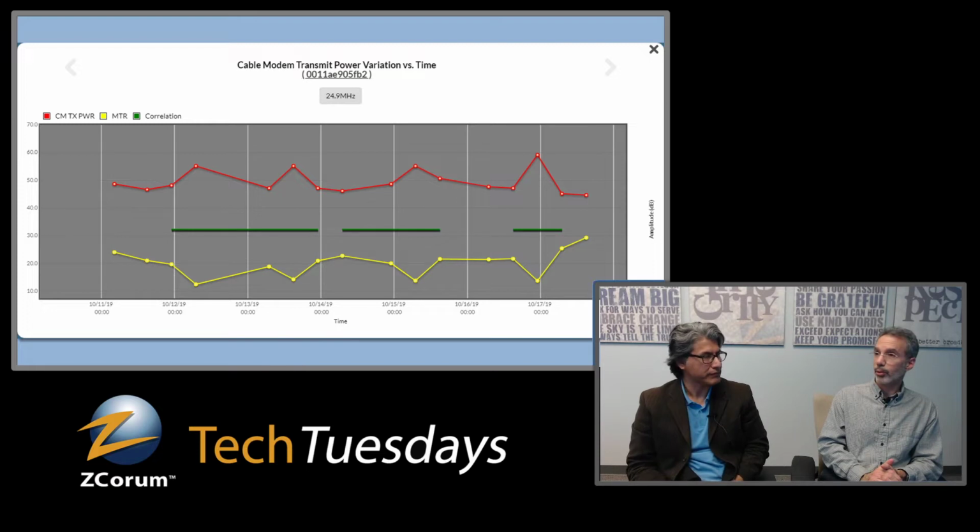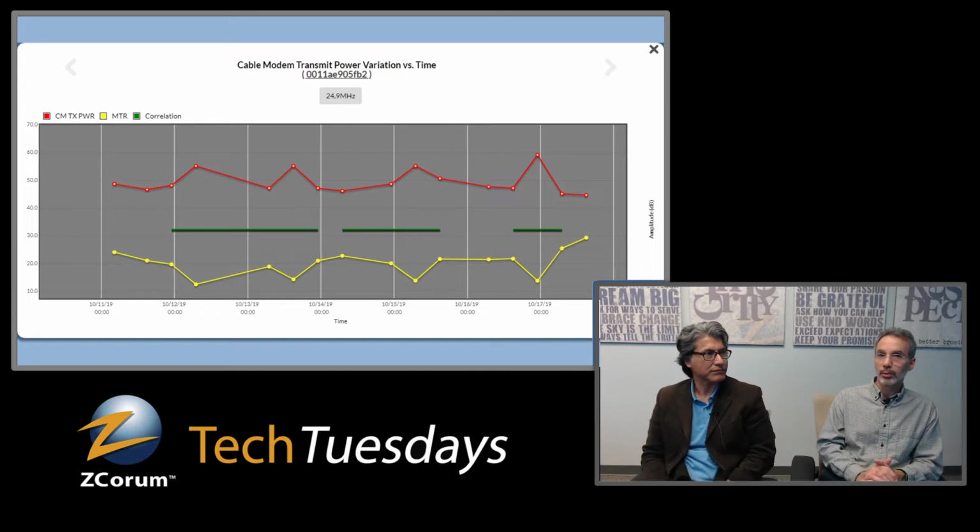Now you could go to the tool and look at the digital taps and see if they've changed, because on the P&M tool, when you look at taps 9 and 10, those indicate a near home problem, or an in-home problem. And if you saw those before and they were elevated, and you saw them after and they're not elevated, that could be an indication that you fixed the problem.